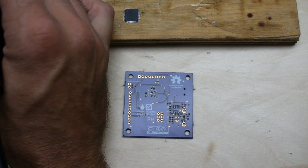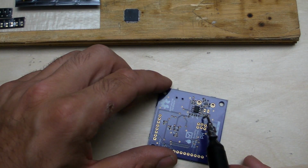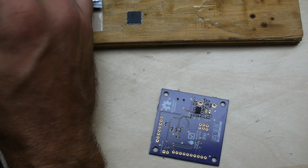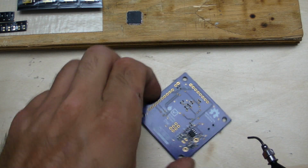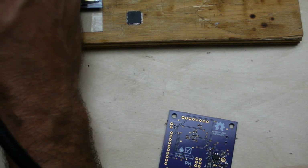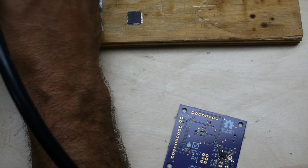So then we'll place our op amp here, like that, and we can place our AC decoupling cap there. And our gain resistor. And we need our charge pump, of course. Can't forget the charge pump. And when we're there, I'll go ahead and do its decoupling caps. Flyback capacitor. And IC bypass. Then we have our other gain control circuits here.